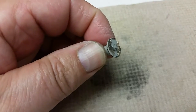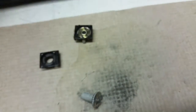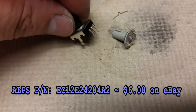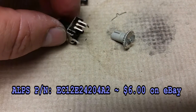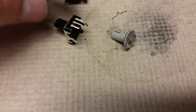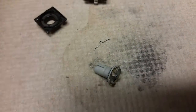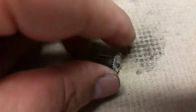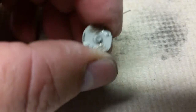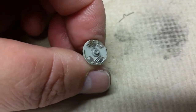There is a link in the description on how to replace this encoder. It's not a direct replacement, but it is a replacement you can wire in. Here's the replacement one — it's a little smaller. Instead of pushing these through the holes, since they don't encode the same way, you basically lift them up and run wires instead. The mod shows you how to do that. But if you're looking for a quick fix until you can get one and do all that, this could be a temporary fix, because these things are old and wearing out.